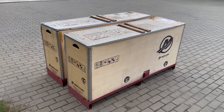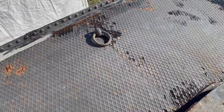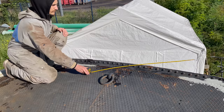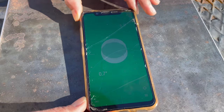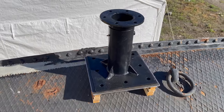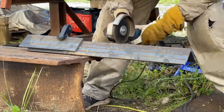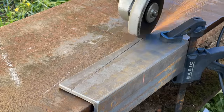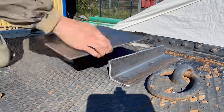The next step is to attach the outboard motors. For this I got one of these little cranes which I plan to install at the aft deck. First I have to find the right position so I can lift each outboard motor right above the center of its respective transom. Because the aft deck has a slope, I'm going to have to build a leveled base first. I'm using an app that uses my smartphone's gyroscope to determine its spatial position. For the foot of the base I'm using an 80 by 80 by 8 millimeter L-profile — I cut two pieces, trace the angle of the slope, cut away the excess material, and double-check if everything fits together.